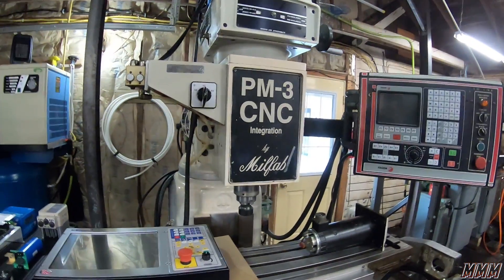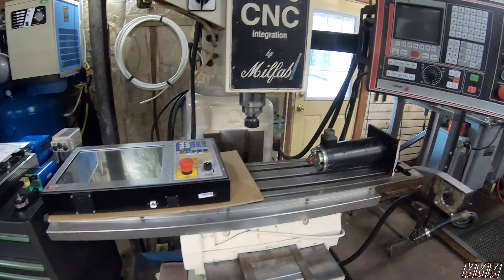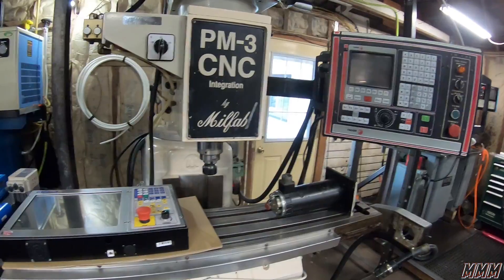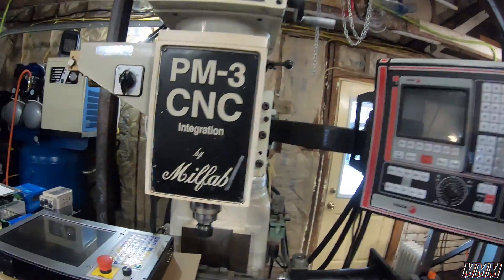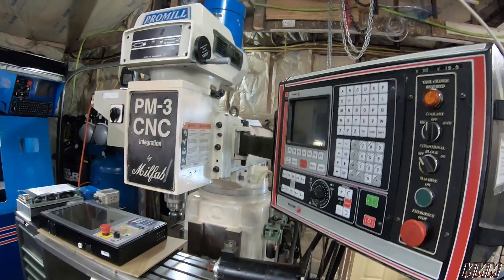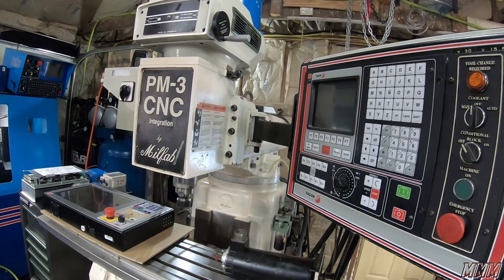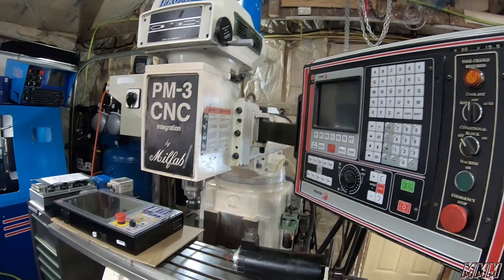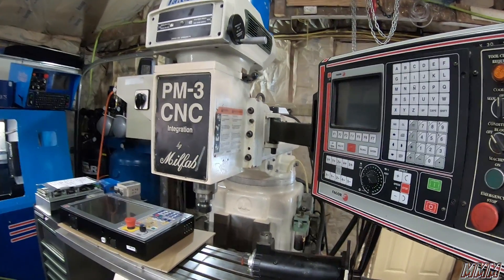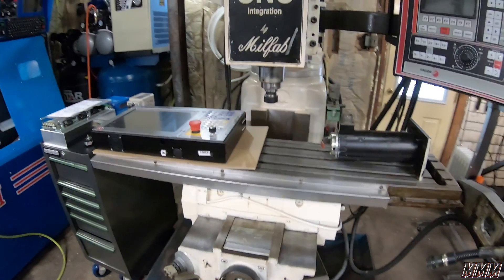The rapids and machining speeds — this has 400 inches per minute, whereas the Tormach has 110 inches per minute. So this is four times as fast. You can get a servo upgrade for the Tormach, which puts the feeds up between 300 and 400 inches per minute. I believe that's a $2,000 option, though, to go up to servos on the Tormach when they're just standard on this.